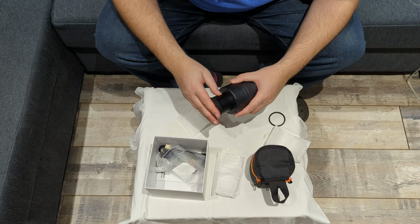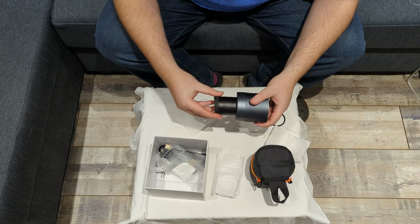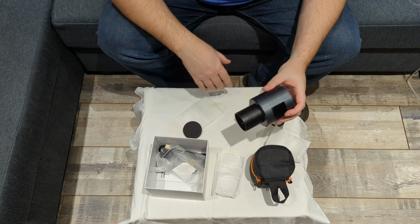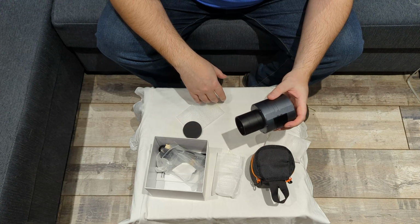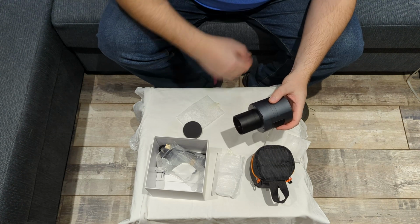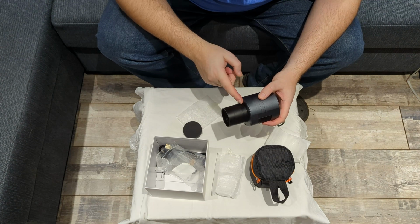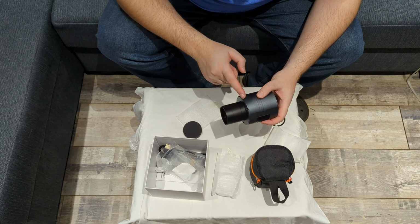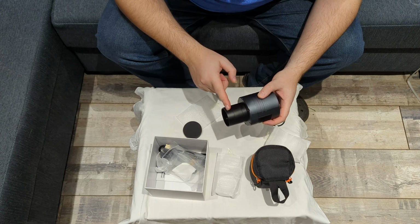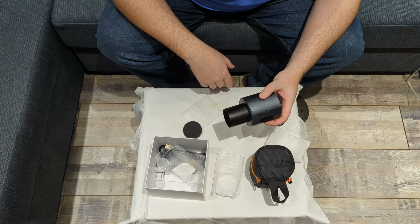Will that even fit on the end of that? That will even fit on the end of that, should we want to do it. But yeah, that should be enough for the back focus part of it. I haven't got anything to hand to measure it, but my understanding is that is enough. So you've got 6.5mm there, 11mm there, 21mm there, and 16.5mm there. Add them all up together, that should be 55mm.